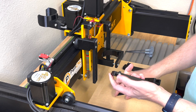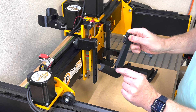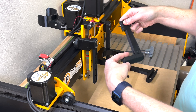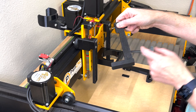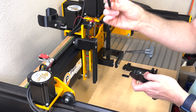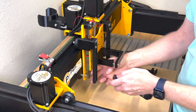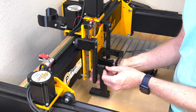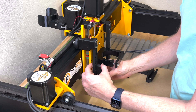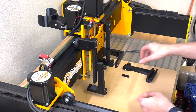Place your thumb screw here. The bottom part should already be assembled using a 20mm socket head screw dropped in from the back side, with the M5 locking nut up top — they screw together to hold the bottom track in place. Once that's done, take the track nut, drop it in, and hold it up about an inch. Lift it a little higher, get it started, and tighten it down — it sandwiches in between the track.